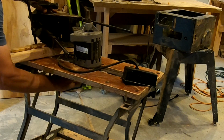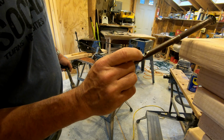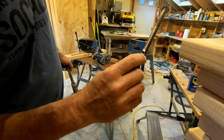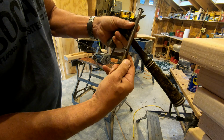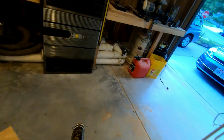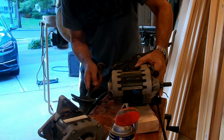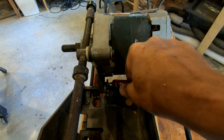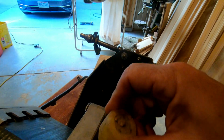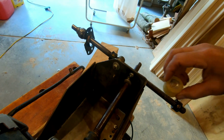I think that does it. Well, I had to drill out that locating bolt. I'm gonna clean that up, make the hole bigger, so I can just run a simple nut and bolt through there, I think. Silly design, glory of the 70s maybe, but it's the way it went together. Put a little Loctite on there too. And while I've got it all neatly exposed here, get wax in these threads.